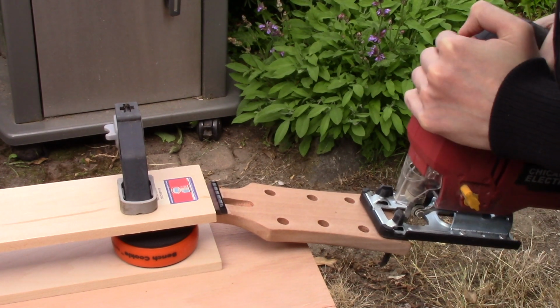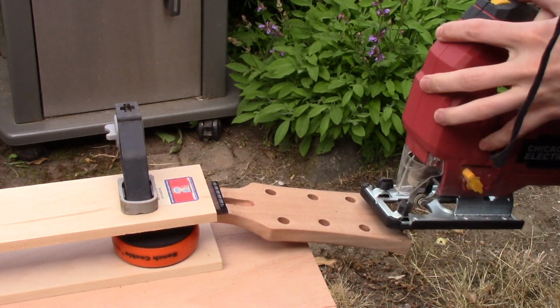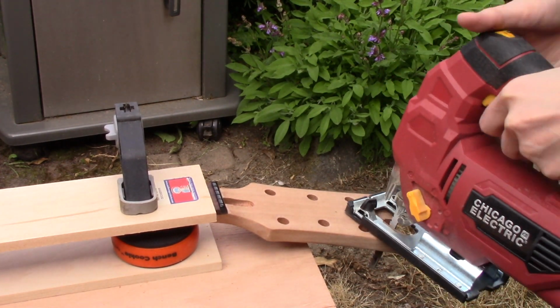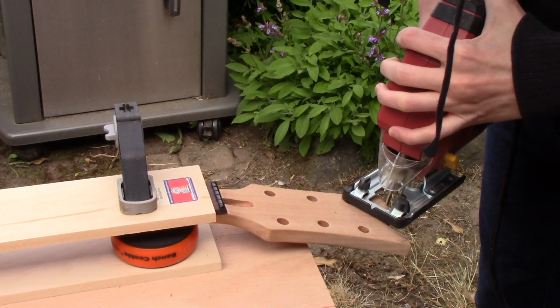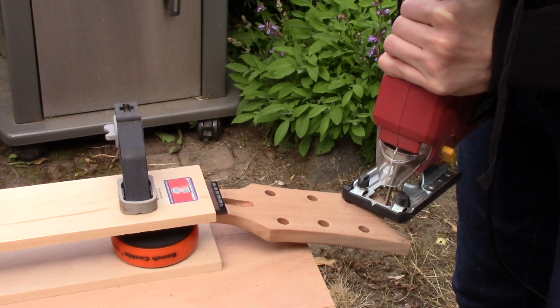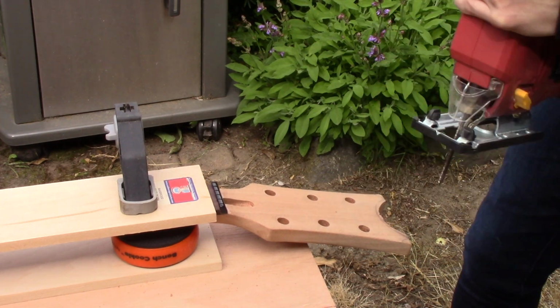Once the neck was secured, I rough cut the shape with a jigsaw. I'm not super comfortable making tight cuts with a jigsaw yet, so I steered pretty clear of the traced line. I alternated between vertical cuts in and cutting against the traced template so that I was cutting off the pieces in smaller chunks.